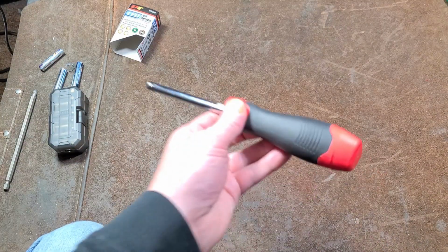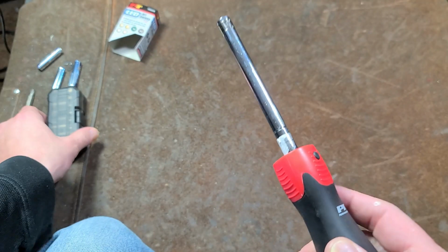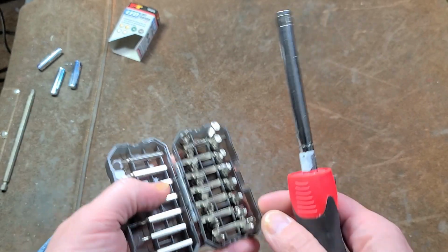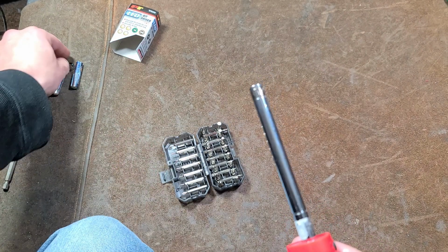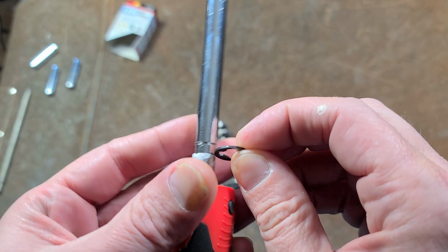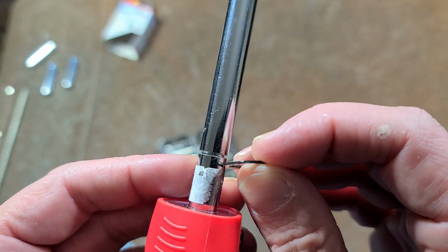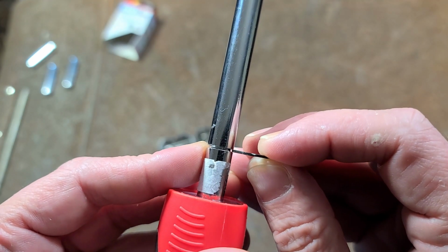Anyway, I did have to modify a little bit. You'll notice this little undercut on the shank. That's how it came with a little bit set, and this bit set actually attaches to the end of the screwdriver. How did it attach? They had this E-clip that was one of the stiffest E-clips I've ever found. It's definitely never falling off because they cut the slot a little undersized. So not only is it an E-clip, it kind of gets press fit into the slot.